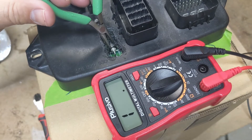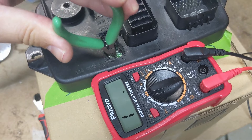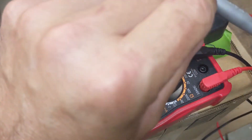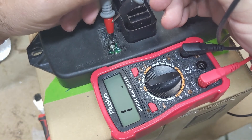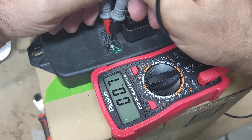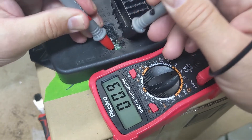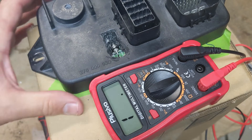We got that soldered in place. I'm just going to feel this and make sure those are really attached good. Then I'm also going to do a quick conductivity test with my meter — I'm going to check down at the base of this motherboard and the top of this diode and make sure I'm getting basically full conductivity. Same thing here. All that looks pretty good, so I think this is in here okay.